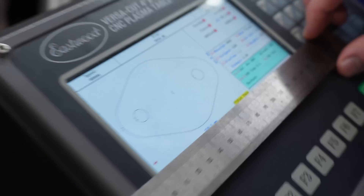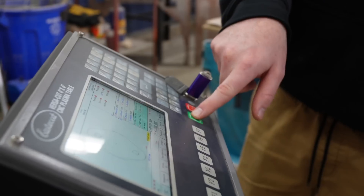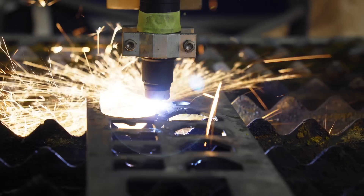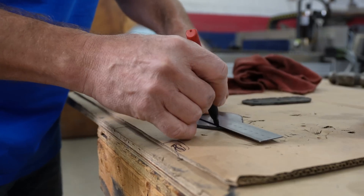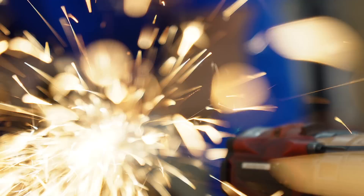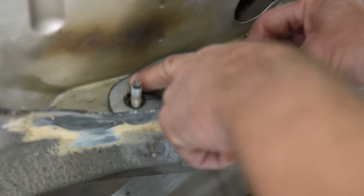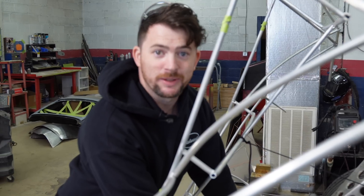It was just a little bit off. I did 40 mm in the center, dropped the ends to 13, and then cut off on the inside. After adjustments to the first flange, incorporating a revised shape gives us more room for our tubing to land and also fits within the space. Tony didn't have to use a computer, which is good for him because he hates computers.